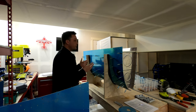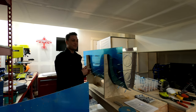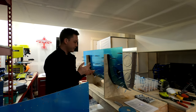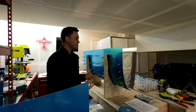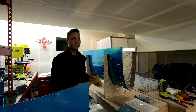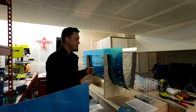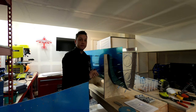We got to work on the fuel tank and we got a bit carried away because I just started fitting ribs. I was intrigued to see how they would fit, and here we have a fuel tank. Unfortunately, that's not what the instructions say to do. It's fine, I wanted to see how it fit together anyways, but I do have to remove some of this because the order of operations is a bit different than the wing tips. So I'm gonna pull some of these clecos and we're actually gonna sort of reassemble this on the spar itself.